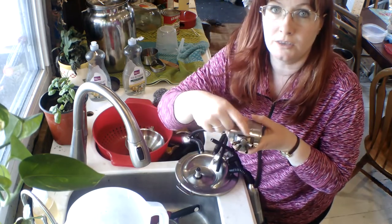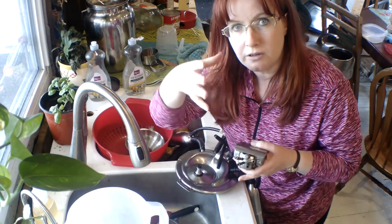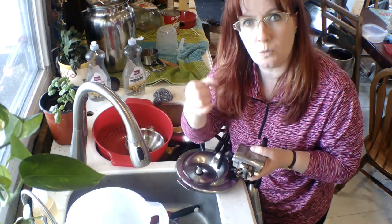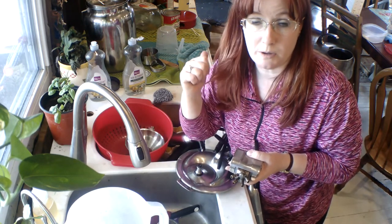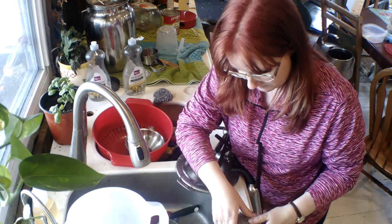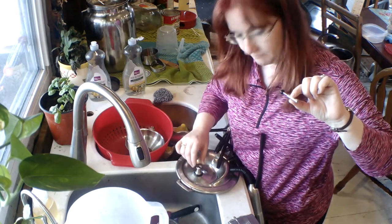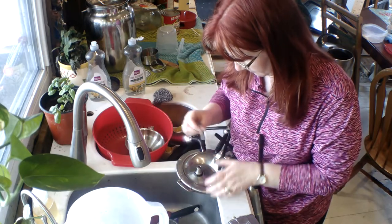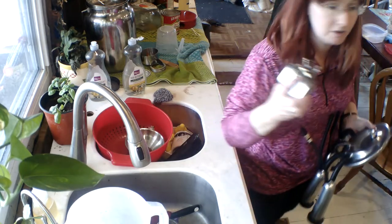This little turn thing here regulates the speed of the suction. And we just kind of adjusted it to match similar to what our hand was doing. It doesn't adjust pressure, because that's what the vacuum pump does. It just adjusts the speed of how fast the pulsating is going. And then we've got a check valve pin from the lid. It just makes sure that no moisture is coming up. So I'm going to set the pulsator and the check valve aside.